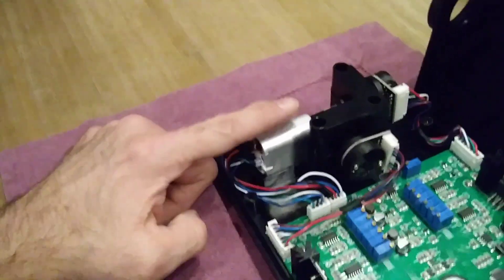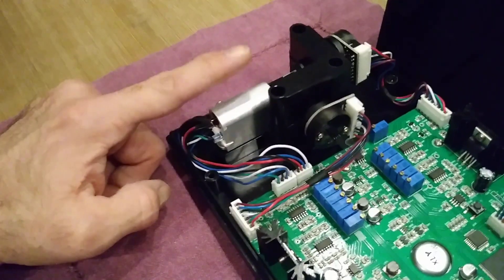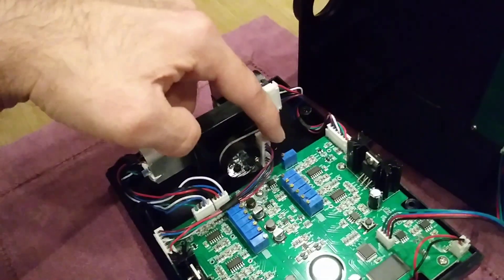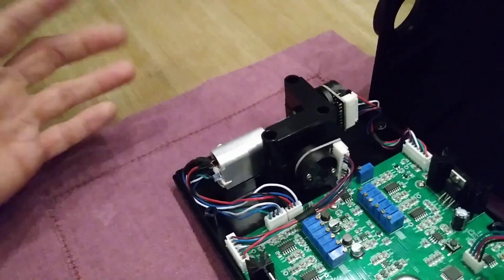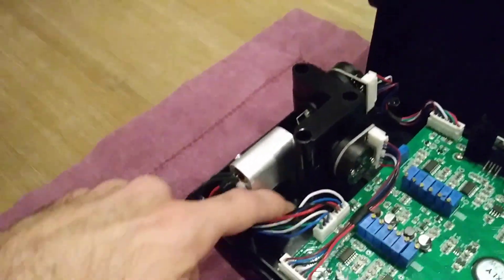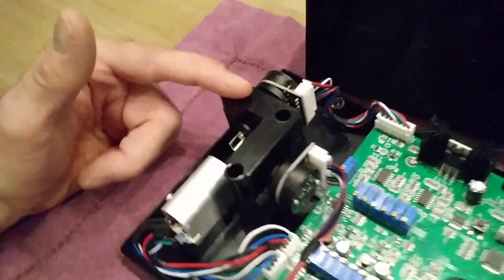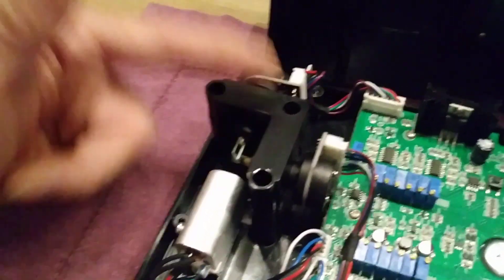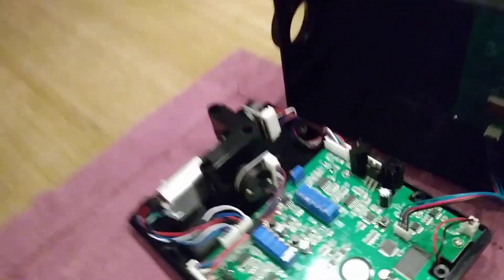On this one I've tested — I adjusted this one for 10 more turns on the laser — and to make sure I will not blow the laser I just touched this one here to make sure it will not burn. With 10 turns that component is just barely warm, it's just okay. As you can see there is no heat dissipation on this one so you have to be careful because it's only plastic. And that's actually the first time I see a galvanometer with a plastic molded mount, but it looks like it works pretty well.